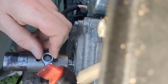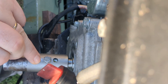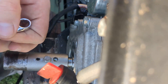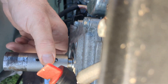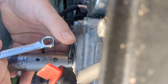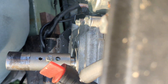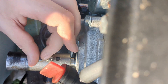This is why we don't put both bolts in at once — we put the first one in because we can't go this way because of the motor, and if I put the second one in, I can't go this way because of the bolt. So I put this one on, get it tightened down. How tight? About one Ugga — the washer isn't moving, we know the bolt's all the way down, we're in the keyway. Then start the second one, thread in by hand — I don't want to cross-thread these little bolts.